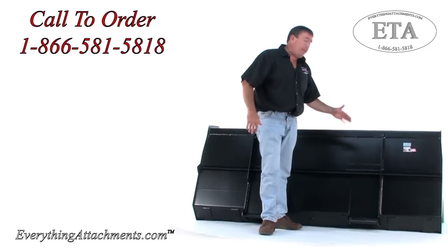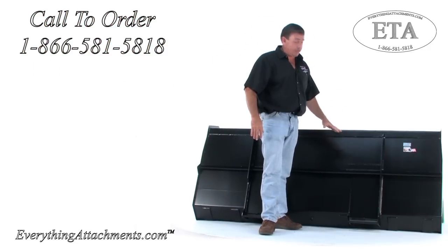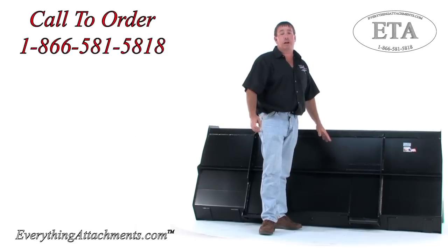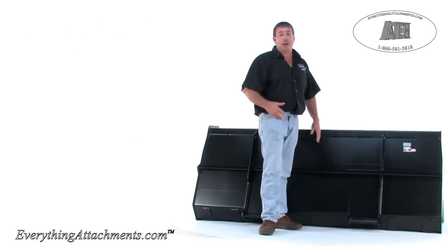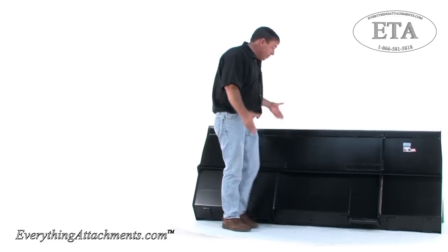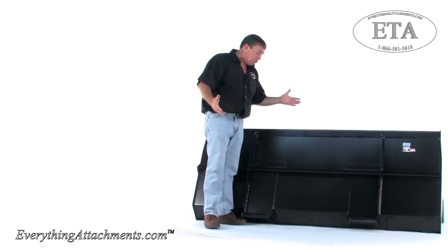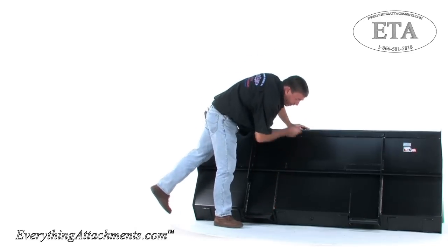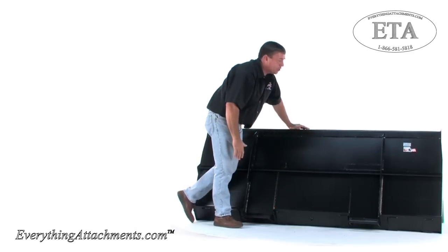Now any type of hitch could be put on the back of this bucket. What's on it right now is what usually comes on most farm tractors and almost all skid steers, which is a universal skid steer attachment, is what we call it, or a universal quick attach, where you're gonna hook it under here, your 2 pins are gonna go in. You've commonly got 2 levers here to do it.